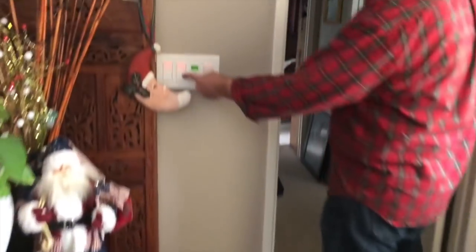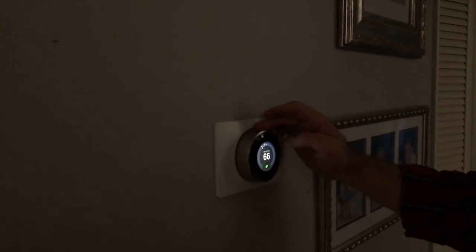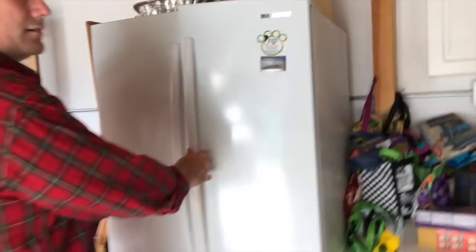Microwave is on. My kitchen light — lights are on. It's pretty incredible to think the entire house is disconnected from the grid right now. You are off-grid in the middle of town. I've got power to all of my lights, my bathroom, and this is where the guts of my internet is — I've got power to that. I'm not going to run air conditioning, but I might run heat. Heat's turning on and I didn't even hear the generator flinch. I've got hot air, I've got lights, I've got internet, refrigerator's on and refrigerating. Now let's turn the power back on to the box — like power is restored — and switch back over to make sure there's no problems with the wiring.